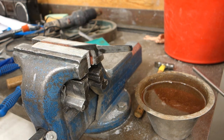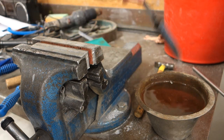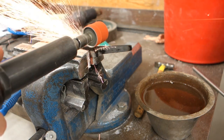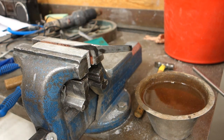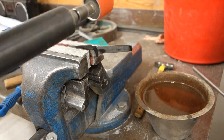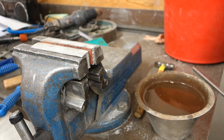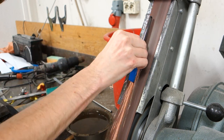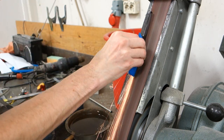The top side of the spine of the blade was ground down to an arc for aesthetic reasons. As the blade was likely stamped out of a bigger sheet of metal, the spine was very rough and unsightly, so a quick trip to the belt sander made the blade look a lot neater. When grinding, remember to cool down your blade often.